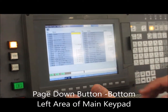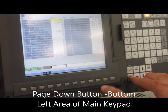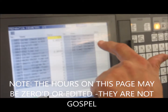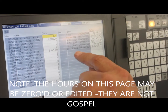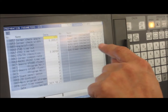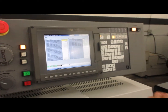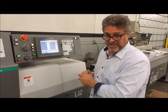These are parameters. I just page down until I see them. I was only one page away in this case, so that's great. And there's the hour meter in this machine. Power on is 12,000, operation 5,279, and auto start 5,087. Those hours appear to be written in hours, unlike the Fanuc controls that put things in minutes.